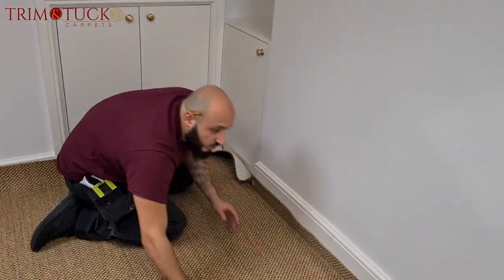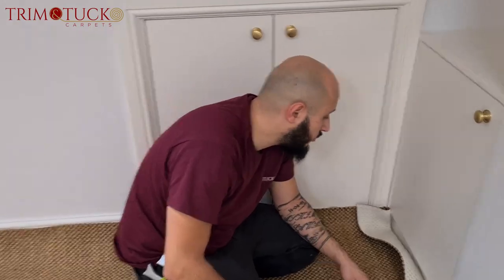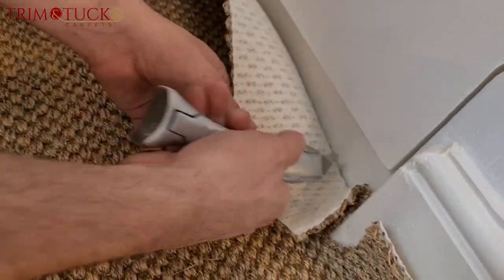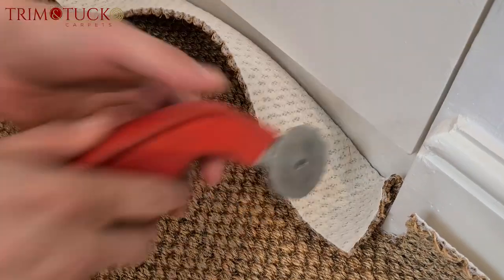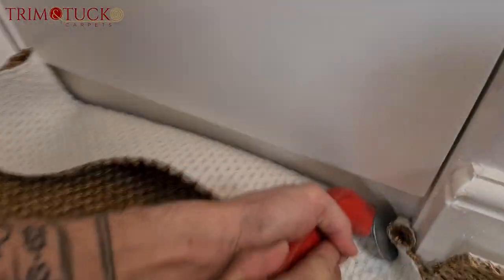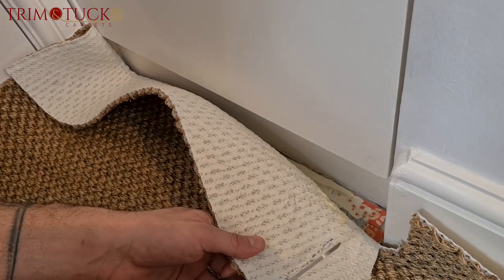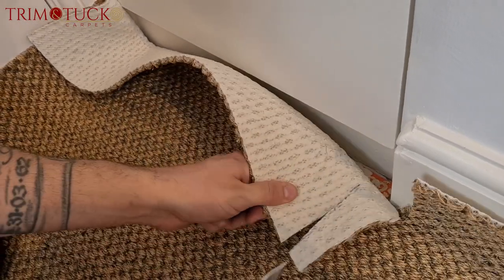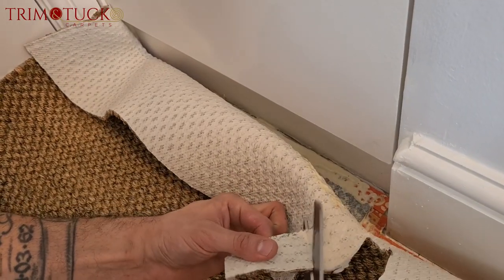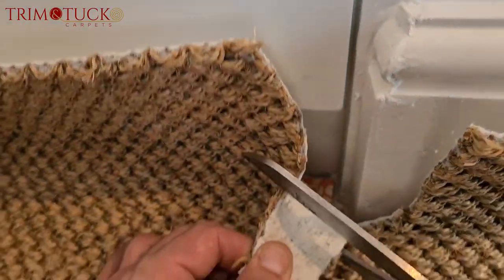But another thing is, this is how I do it, yeah? There's always another way, but I thought I'll show you, like pencil. When you're coming to your corners, I don't like going with my knife and bam, bam. Nah, it's not with this product. I always keep my knife in my holster because it's just worrying. But what I will do is, if you show this corner bit, I will get my corner all mashed in and I'll make sure I know where it is and I'll draw a line, yeah? Then I'll come with my scissors and I know exactly where to stop. So that's where I stop. Then I can cut this off. I can cut this diagonally. And then when that drops in, still a bit much, but you can get the picture of what I mean.